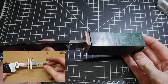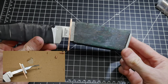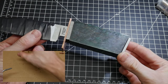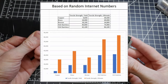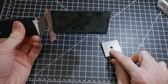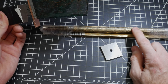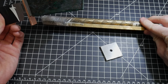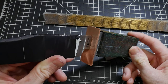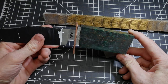I do have a bedded handle, however I broke my pommel nut. The pommel nut had a shank diameter of a little less than a quarter of an inch, which is just too small for 10-32 threads — not to mention it was copper, which is weaker than stainless. I'm going to enlarge the hole and make a larger pommel nut out of bronze. I'm also going to use bronze bar stock to make a new guard, since the current copper guard has some gapping and I want the materials to match. So yeah, I'm pretty much going to redo a bunch of the work I just did.